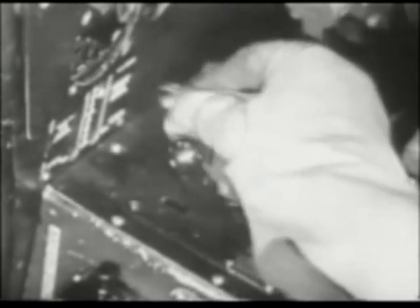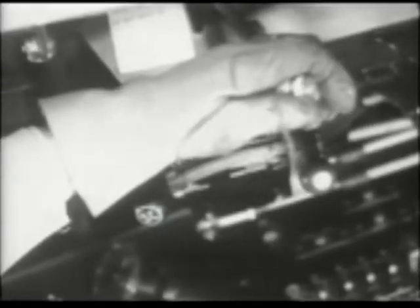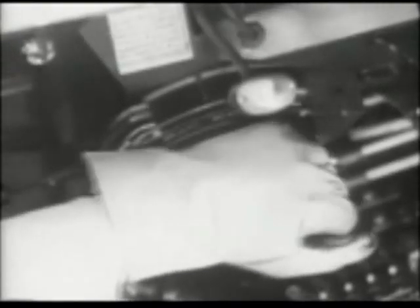You can carry this power up to 13,500 feet, where again you will note a loss of about 3 inches of mercury. If you want more altitude, throttle back to lose an additional 3 or 4 inches and shift to high blower, followed by 48 inches of manifold pressure. Always keep your intercooler flaps about half open when using low or high blower to maintain intake mixture temperatures within safe limits. A red warning light will indicate excessive temperatures and warn you to reduce power. Open the intercooler flaps wide and, if necessary, shift to a lower blower.